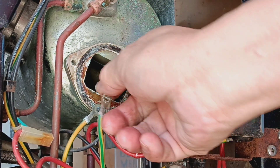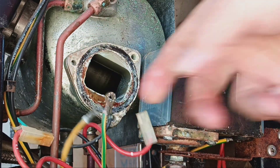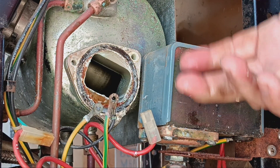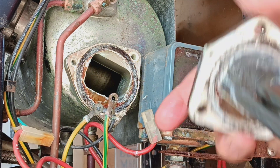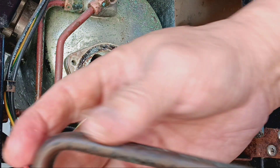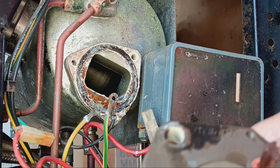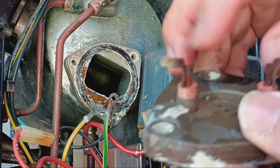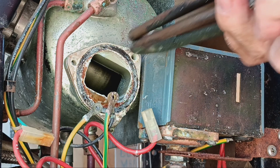There is a very little bit of calcium buildup but not much. In an overhauled machine it should look like this — no sand or anything. With an old machine you'll see it full of crud, especially the green stuff. No pits, no holes, so I know this element is good — it's probably 1300 watts. You could take a wire brush to the lugs to get the rust out, but they're just shiny enough to use.